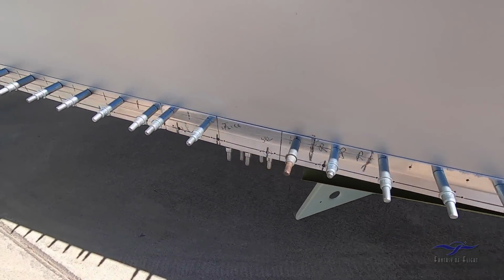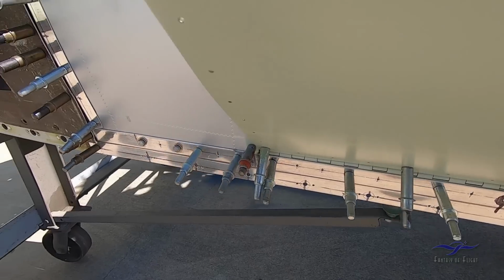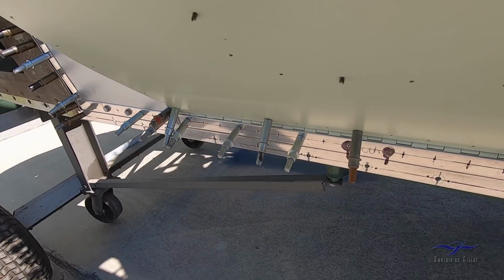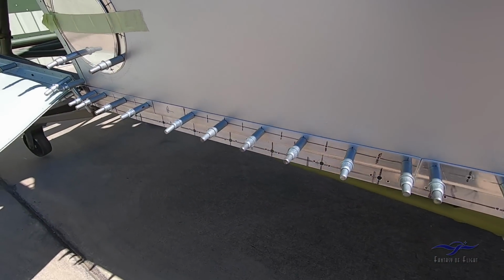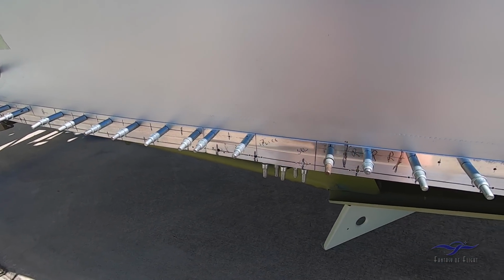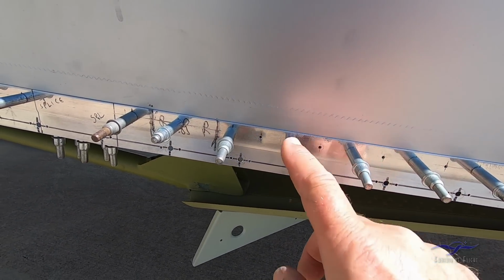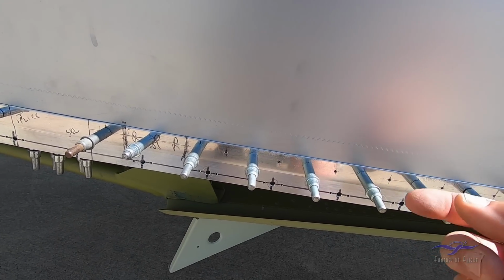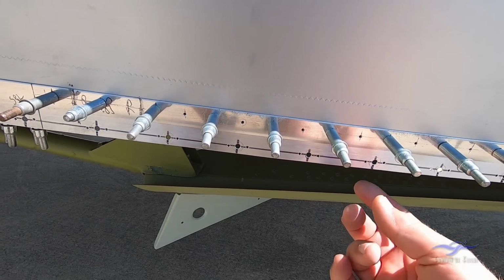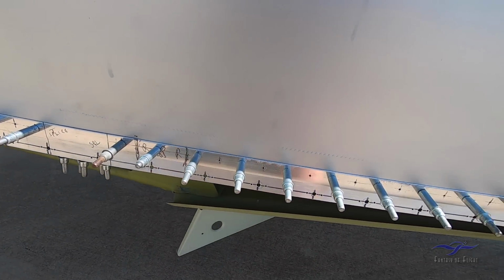And we have this strip running right across the front of the lower monocoque here, which picks up all the wing fillets that will come off, sweep up off the wing centre section, and also sweep back towards the rear fuselage. So all these small holes here will be rivets that will go through the timber shell inside, and the metal channeling on the other side of that. The lower part of this joggle strip takes anchor nuts to pick up all the wing fillets.